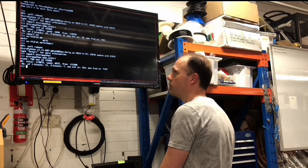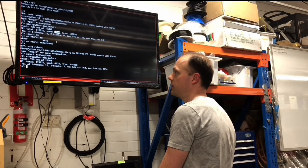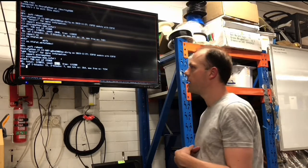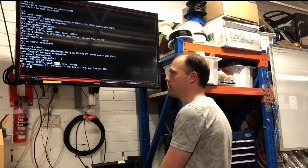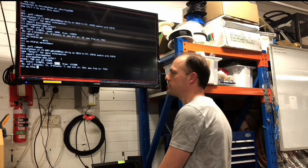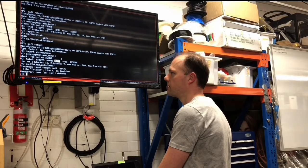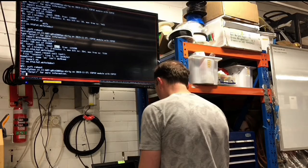You can see here we had 1K used to start with — that was with LittleFS. Now I've switched it back to FatFS and used is at 4K. You can very easily switch between LittleFS and FatFS by doing os.VFS, say LFS2.make on the block device. And so we can switch back. That's pretty cool.